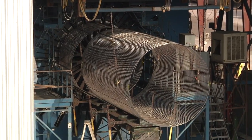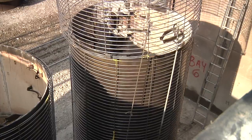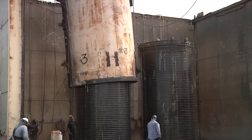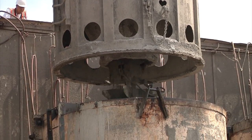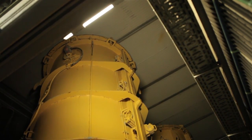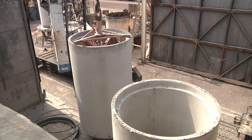Once the cage reaches the design length, the longitudinal rods are cut and the newly made cage is separated and transported to the concrete placement area. Before placing the concrete, the newly formed steel reinforcement, or cages, are positioned outside the steel cylinder, while inner and outer forms encase the cylinder and cages. Concrete is batched to a specified design mix and placed in the forms, encasing the steel cylinder and cages. The pipe is placed in a cure cell for elevated temperature curing with steam. After the initial cure, the formwork is removed. Once the concrete reaches the specified compressive strength, the pipe is ready to be shipped and placed into service.